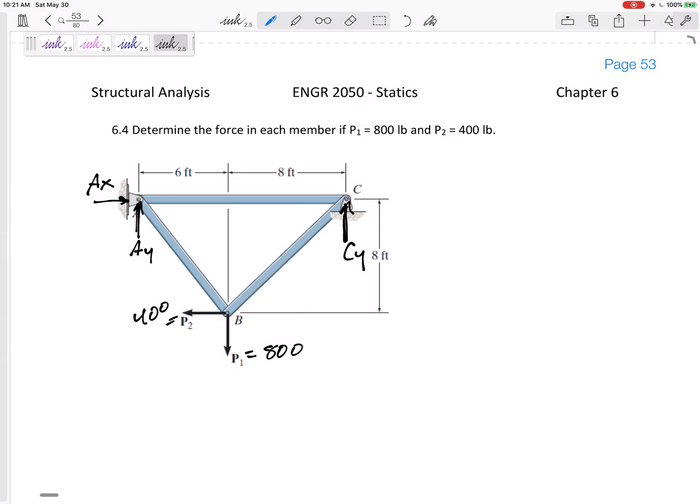I could go back to my whole free body diagram at the end to double-check — those will be my three redundant equations to make sure everything is still in equilibrium. But sometimes, especially depending on what the problem statement is really asking for, it might be helpful not to look at the whole free body diagram first. So I'm going to start at joint B.